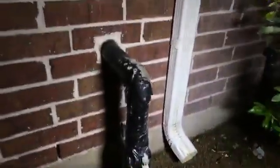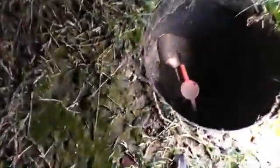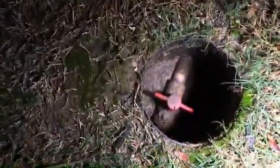I'm first going to go to the front of my house to find the main water valve. My water valve is actually underground — there's my main line right there, but the sprinkler valve is under here. I'm gonna open that up, and that's my sprinkler on/off valve right there. I need to turn this halfway, now it's 90 degrees, and that tells me my sprinkler system is off.